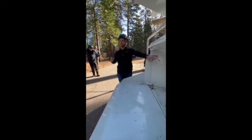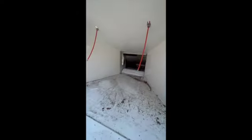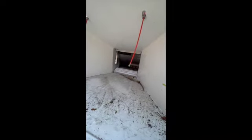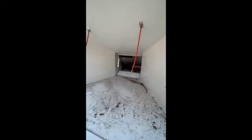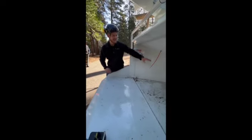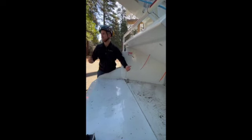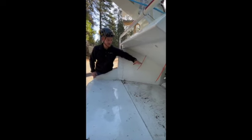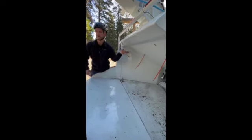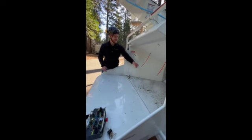Now your anvil is four-edged. Now I say that with an asterisk. On top of your maintenance, it's four-sided, but if you let your anvil round over like this, it's two-sided. The reason I say that is if this rounds over to where it eats into the backside of that anvil, it's two-sided. So right now you have this side, you could flip it here, flip it upside down, and then flip it back around. If I was double jointed, I could really show you.